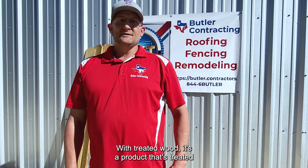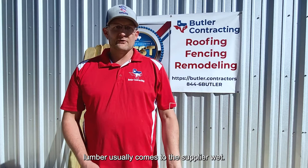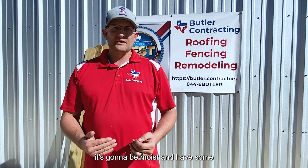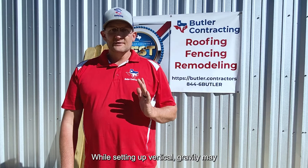There are a few key distinct differences between treated and cedar. With treated wood, it's a product that's treated and has chemicals and water and moisture that's used in that treatment process. And when that's done, that wood and lumber usually comes to the supplier wet. Now, when we install it and put it up, it's going to be moist and have some kind of moisture content in it. When we get done with that installation, that wood's going to slowly dry over a period of time after installation. While sitting up vertical, gravity may or may not be our friend at some point.